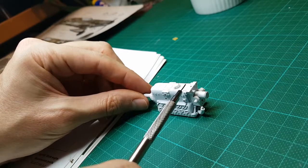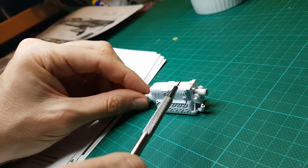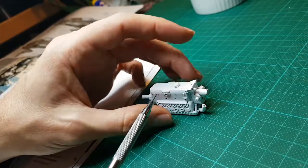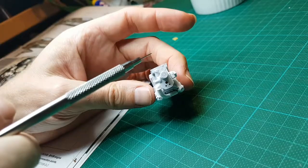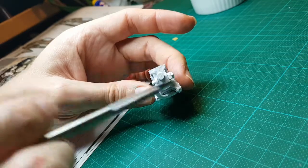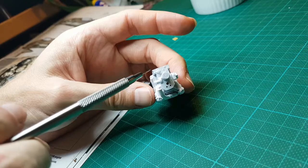The supercharger will attach here, and these are the mounting points. Up the top here will be mounted the interrupter gear location, which will fit on there. And the magneto goes up there as well. Looking at it end on, this is where the inertia starter is, which is wound up when the engine is started. The hydraulic pump is up here.